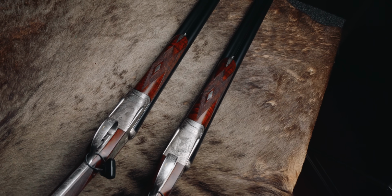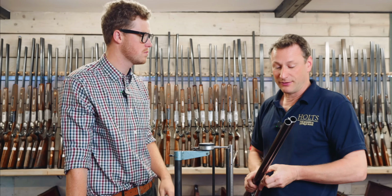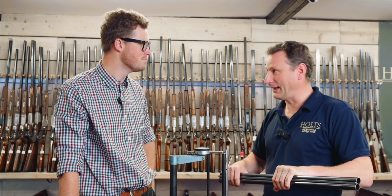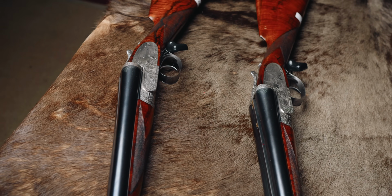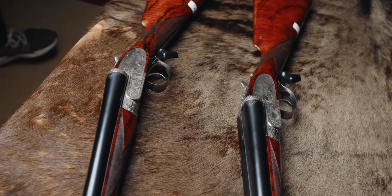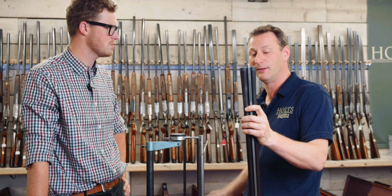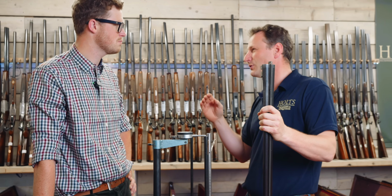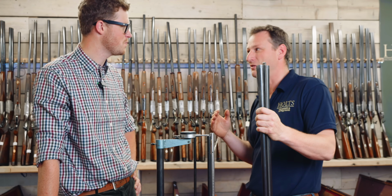We'll go on to talk about the wall thickness of a gun barrel as well. So, the barrel is the tube of steel that holds the pressure charge that drives the shot out. Obviously, the barrel is under quite a lot of stress as that process takes place. Talking of wall thickness, people are often surprised at just how little metal will take the charge going down a barrel. For auction houses, we recommend that our cut-off point is really 20 thou thick. Coke cans are usually between 4 and 5 thou thick. That's not a huge number.